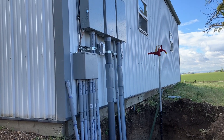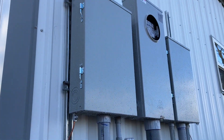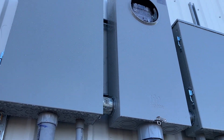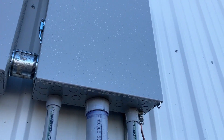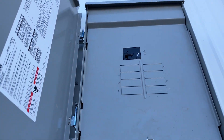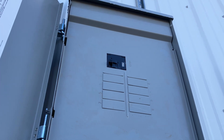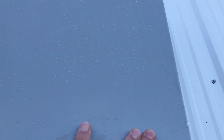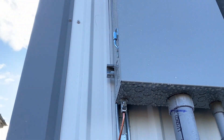What we're looking at is a low voltage can here, a 200 amp disconnect on the left, a 400 amp meter base in the center, and then another 200 amp disconnect on the right. These disconnects are made to service a house, barn, or shop that's going to take 200 amps. This one is actually for a future barn — you can see it has areas for breakers. And the other disconnect is the feed that goes to the house.